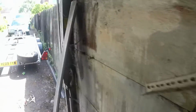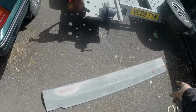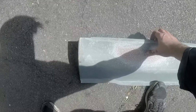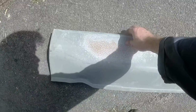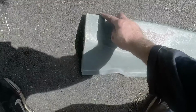Dotty originally came with a pair of these oversills. These are the sorts of panels that ordinarily I hate, because you can buy complete sills for the cars, perfect, for not very much money. So this is not a proper sill. This is a pattern part that just gobs on over the top. But what it does have is the right profile already here.